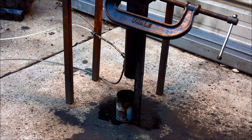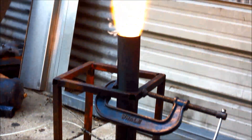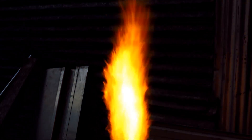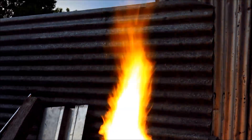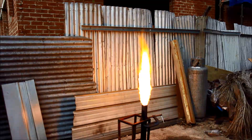One of these days before I do a light up I'm going to have to remember to tighten up those fittings. I think this is the third or fourth video I've done of this and I still haven't remembered. So there's your construction tip — make sure you put the thread tape on all the fittings the first time you do this. That way you won't get that bit of dripping oil out the bottom. There's a little bit of a wider shot — that fence is a little bit over seven feet tall in the background, so I've probably got about a three-foot flame there.